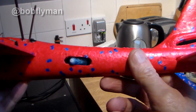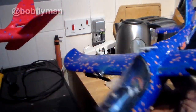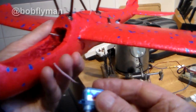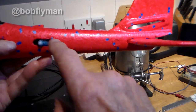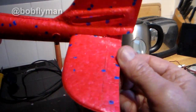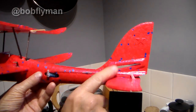Servo in, and I even managed to get the wire down through a hole into the fuselage so it's completely hidden, unlike some of my earlier builds like the mini little twin. I extended the wire using the lead from a dead servo. Everything is now coming through to the cockpit — I'm getting close to putting the wire across to actuate the elevator.